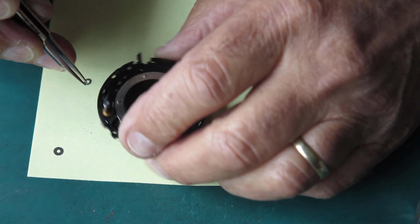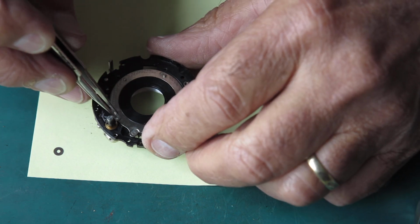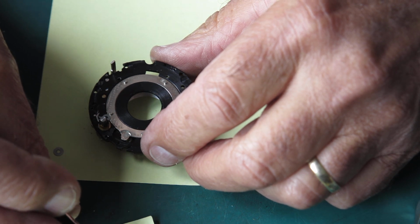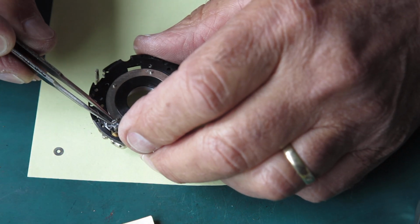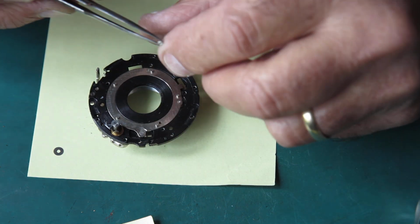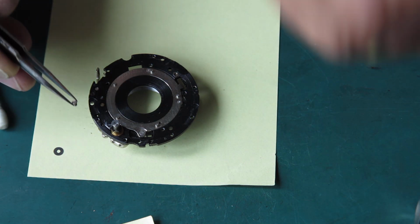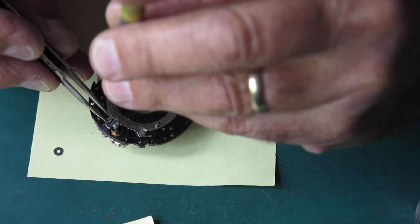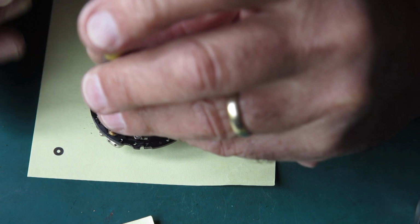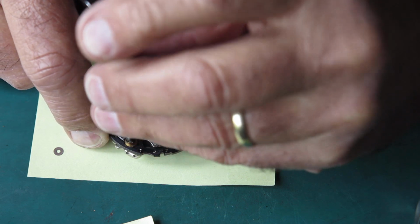Now we had two small washers. One sat there. These screws are a little bit awkward to get placed. They are quite short. They've got almost no lead on them, so they don't start easily. And of course they're going into aluminium, which is relatively soft, and you can mess those threads up.